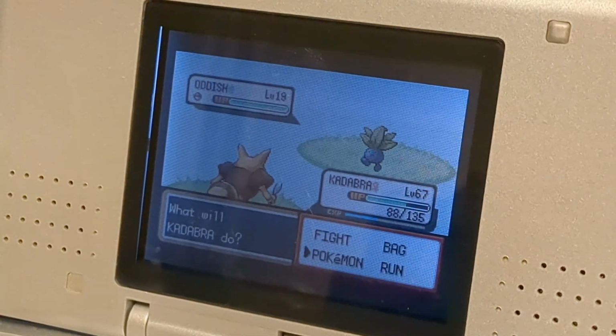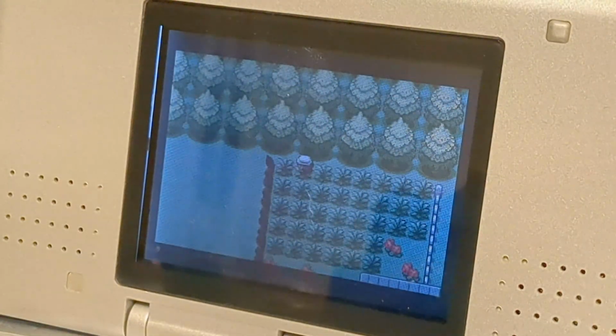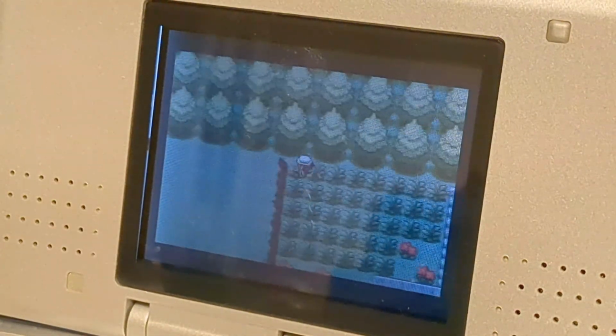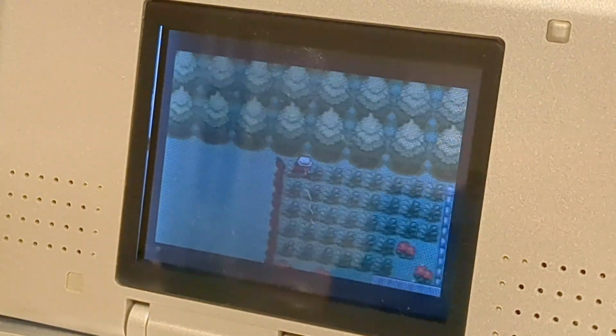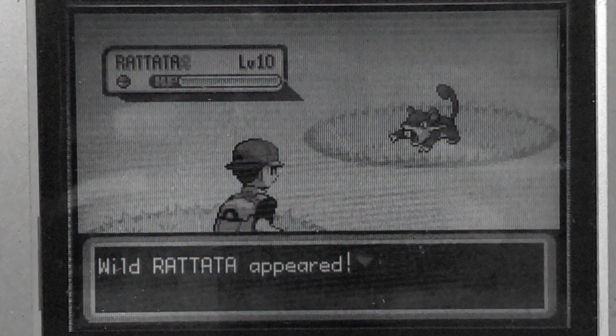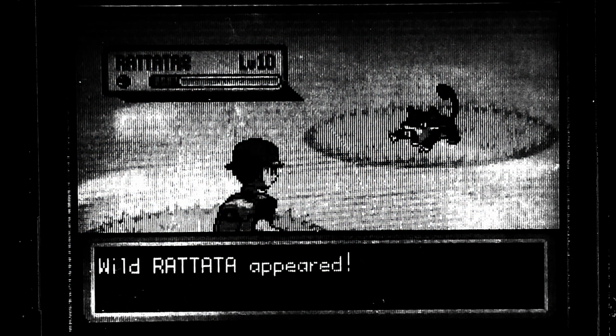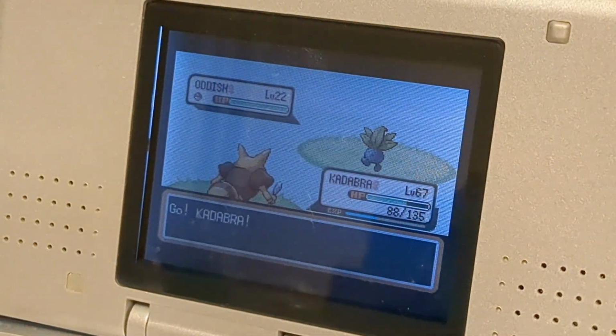And so here's what I came up with. OCR, object detection, any fancy thing like that, straight out the window. Instead, I resorted to a very basic technique that works nearly flawlessly. By running the images through the processing I just mentioned, I simply count the white pixels to see if they're above or below a certain level. This is a very similar method to the photoresistor last time, but allows me to pick out more detailed parts.